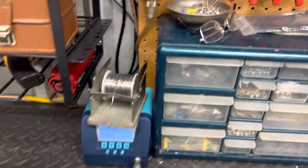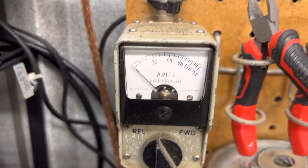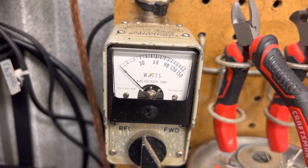We'll start out looking straight through the rest of the yard like we always do. This is the reason I looked at it a while ago — I hooked this thing up straight through, SWR was high. I had a cold solder going on the relay. Hello, one two three, one two three — that's why we always check it. Getting on down, straight through SWR. Hello, audio — alright.